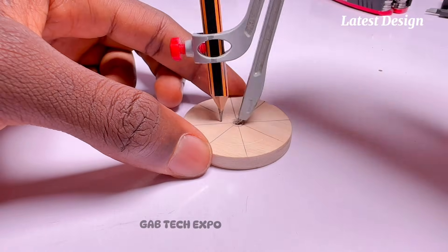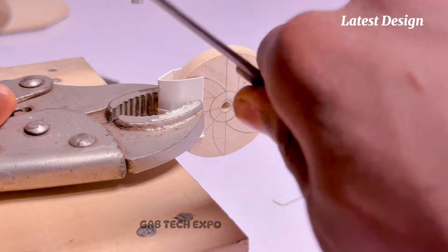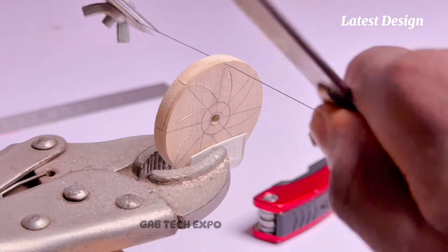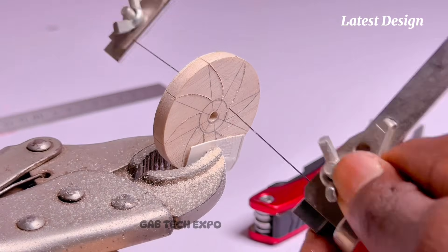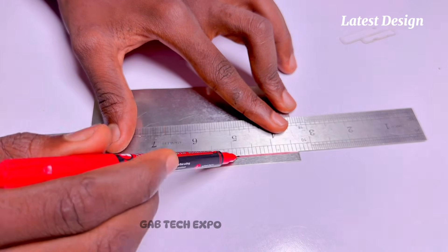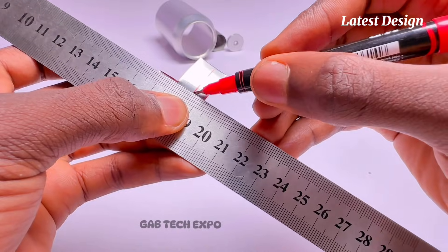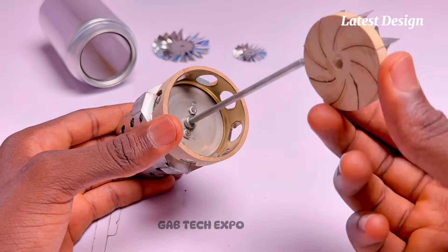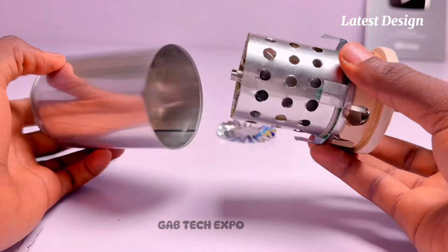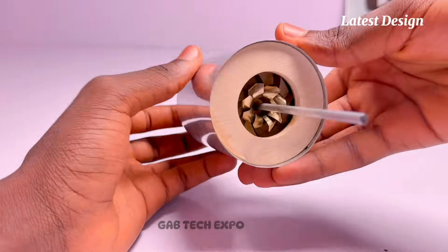This helps us understand why these engines' housings were built differently. The reason why the engine with the centrifugal compressor has a wider housing is because the centrifugal compressor, as its name implies, was designed to suck air from the intake and force it radially through a dedicated diffuser concentrically aligned to the compressor, to help get compressed air to the combustion chamber at high pressure, thereby requiring a wider housing to hold both the compressor and its diffuser vertically in the jet engine.